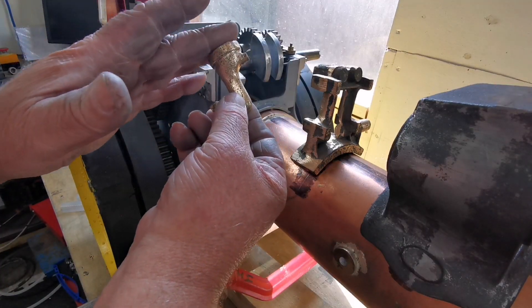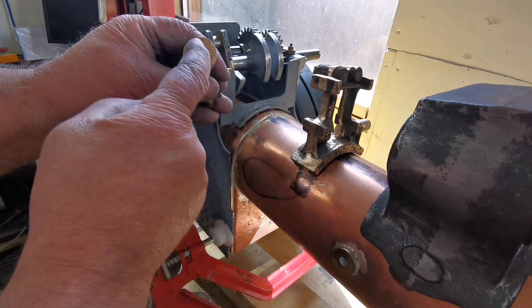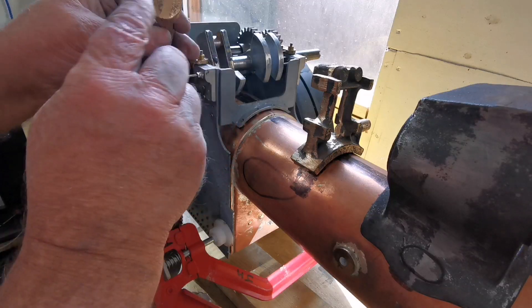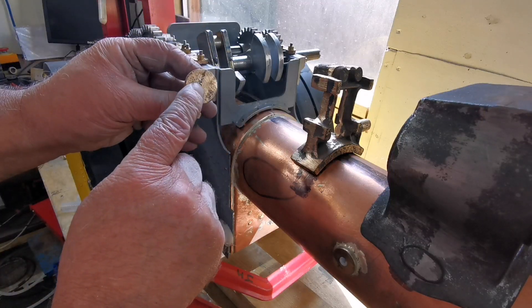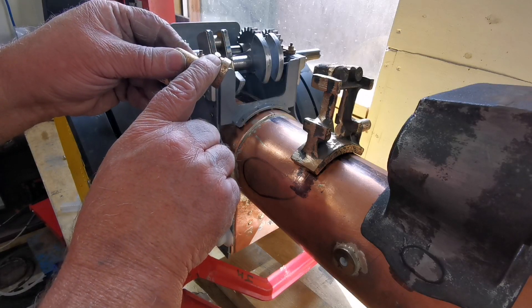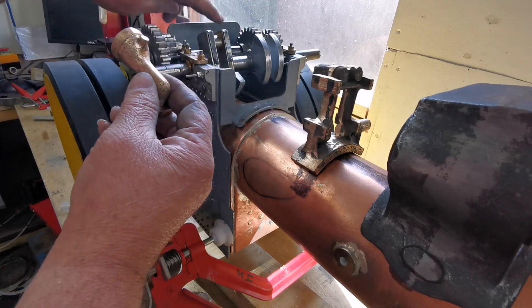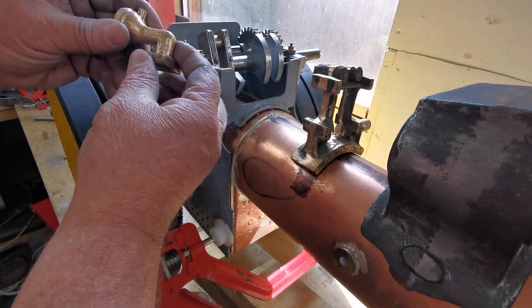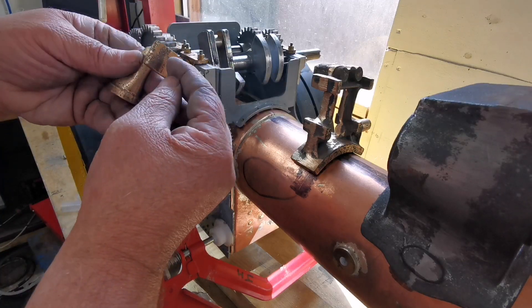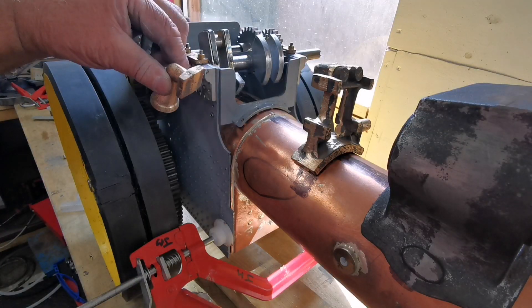I can now start machining the bits that I've got to fit onto the boiler. I'm going to start off with a manifold — this little thing here. It's going to be faced up on this face, and there'll be three holes: one will be for a steam outlet which will go to a pump of some kind. The two other holes will be drilled and tapped, and in this little knob there'll be a small steam outlet going to the pressure gauge. There will also be two fixing bolts and a hole straight up through the middle to allow the steam to come out of the boiler.